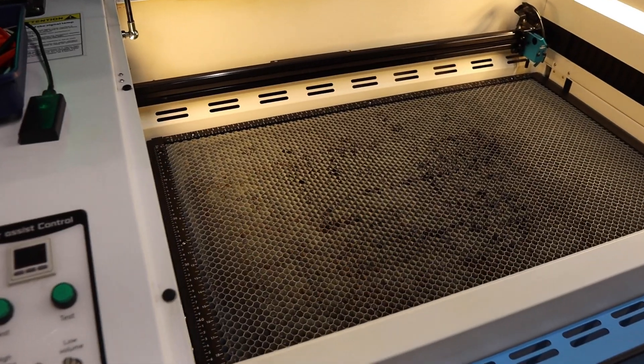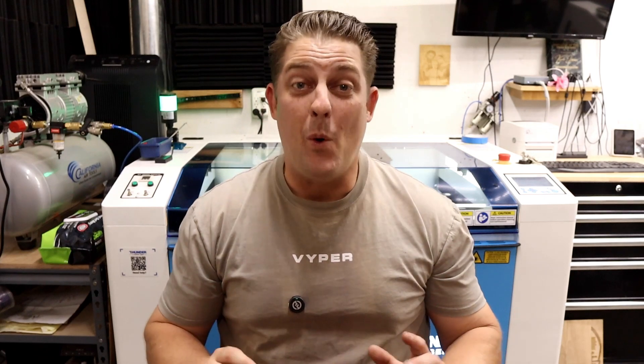And that is it. My honeycomb bed is all dry and reinstalled into the machine — time to get back to work. How often should you go through this procedure? That totally depends on how much you use your laser. Generally, you should be cleaning your laser in some form every time you use it, but that doesn't mean going through every single one of these steps. We clean our focus lens multiple times per day if we're doing a lot of cutting or engraving — it's so easy to remove and replace, there's really no reason not to keep it perfectly clean. We don't clean the mirrors every day; maybe mirror number three because it's exposed to smoke, but mirrors one and two are well protected. Regular maintenance not only improves your results, but also protects your investment for years to come.